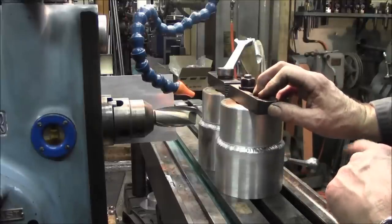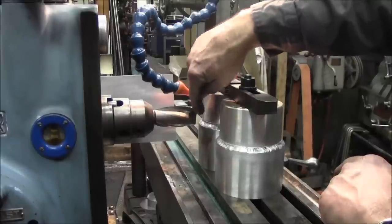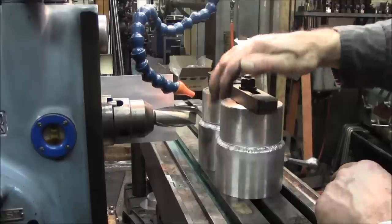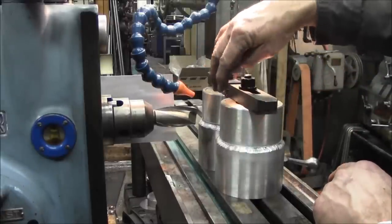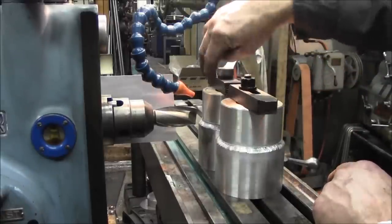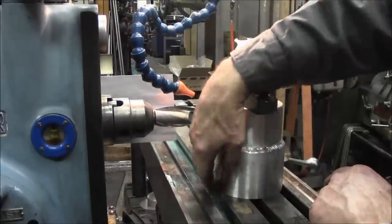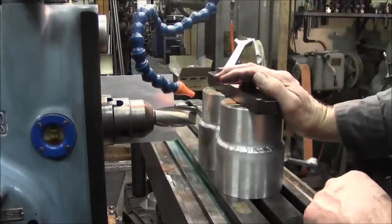So we're set up here in the mill. And we're going to go ahead and come in, we're going to touch this surface, and then we're going to make a pass across. We're going to get to the depth and the opening we want on this side. Then we're going to undo it, clean our table and everything else, turn them around, put a flat parallel across both the flats, clamp them together, clamp them back down in line, 180, and then machine the other side exactly the same.